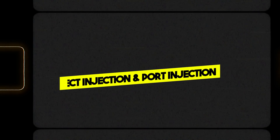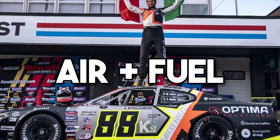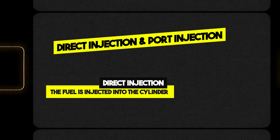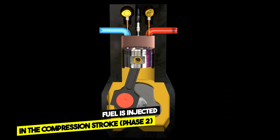At this point, gasoline engines are divided into two classes. Port injection engines have air already mixed with fuel as it enters the cylinder — for example, a carburetor engine where the air-petrol mixture is made by the carburetor. Then we have direct injection engines, where the injector sprays gasoline inside the cylinder — not during the intake stroke, but during the second phase, the compression stroke. This is what happens in most modern engines, including Formula One engines.